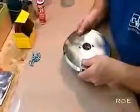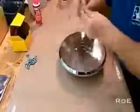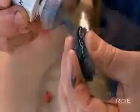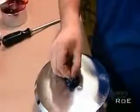Next they cut a smaller and thicker round piece of iron called the core. A reamer bores a large hole through it. They apply super high-strength epoxy glue to the core and to the back plate — the plate with the smaller hole — then glue and screw the pieces together, because the bond has to be strong enough to withstand intense magnetic pull.